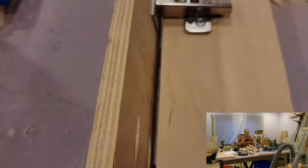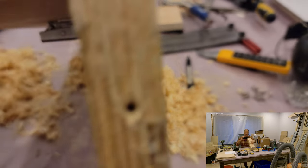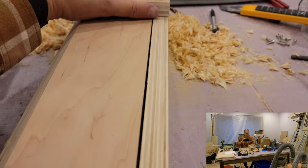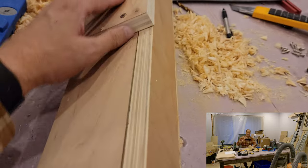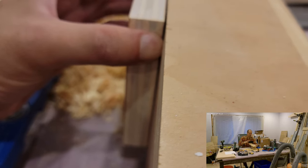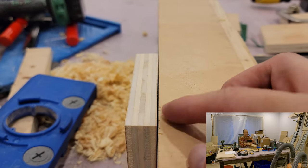So that's number one. In order to make sure that I could put things flush, I put a stopper block on the back, right behind the door. And it was really, really stiff. So to accommodate that, I loosened it off a little bit, so there could be a gap that big, which in the grand scheme of things really is not much. The reason this is critical is because it means I have to leave a gap of that size between every door.